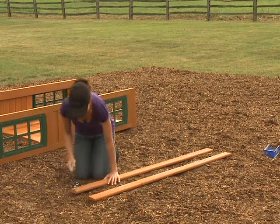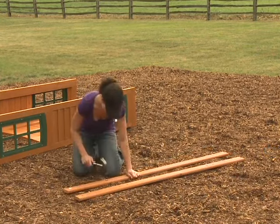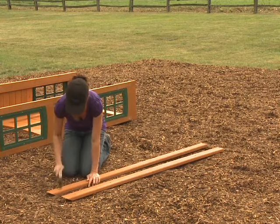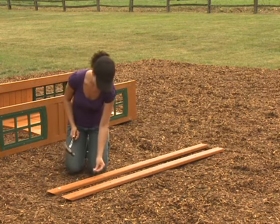Install six 5/16 inch T-nuts in both 041 wall ties and both 042 long wall ties. Install four 5/16 inch T-nuts in both 043 joist sides on the long flat side.